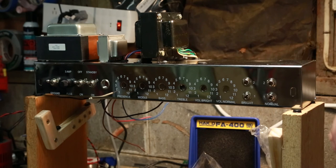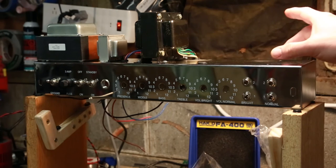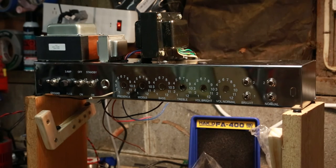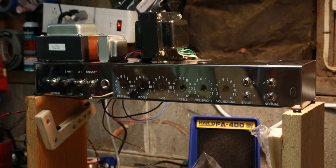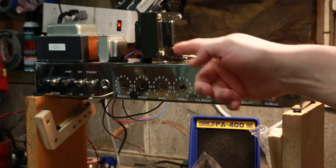One other change I'm going to make — I'll flip this over in a minute and give you a shot — there are four holes here and another hole here. Normally this would be what they call the doghouse where they'd put all the filter caps, then run wires from those out and connect them into the board. But I'm going to do something Doug showed me where you instead put the caps right next to the board itself and connect the wire to the grounding bus. You've probably seen me do it on other amps — those caps just go right next to the board.